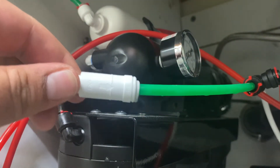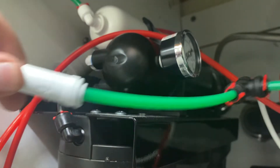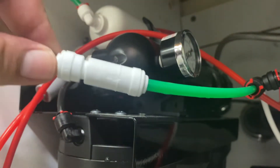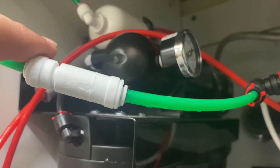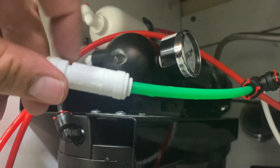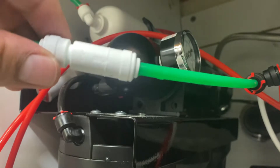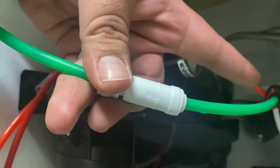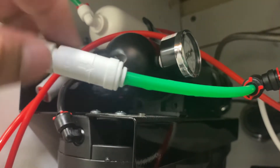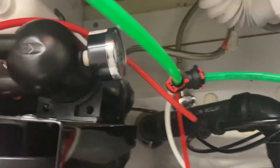Connect to this fitting I sent you. Looking at the fitting, it's pointing towards the T — see the arrow? It's pointing to the T right here. So from the alkaline filter, through this check valve, the arrow follows toward the T. Do not put this in backwards or water won't come out and won't feed the tank. Arrow towards the T — out of the alkaline, through this check valve, and into the T where it goes into the tank and into the three-filter setup.